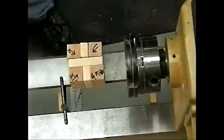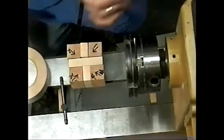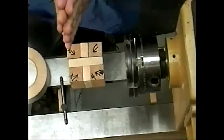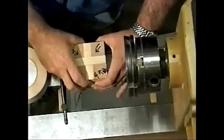Okay? And again, I use the double-sided tape. Now, when I use that double-sided tape, a little tip I picked up from Bonnie Klein. Bonnie taught us this. When you use this tape, go ahead, put it between your pieces of wood, but then squeeze it in your vise, because you get a good hard press there. Oh, about 30 seconds. Yeah, a whopping 30 seconds.